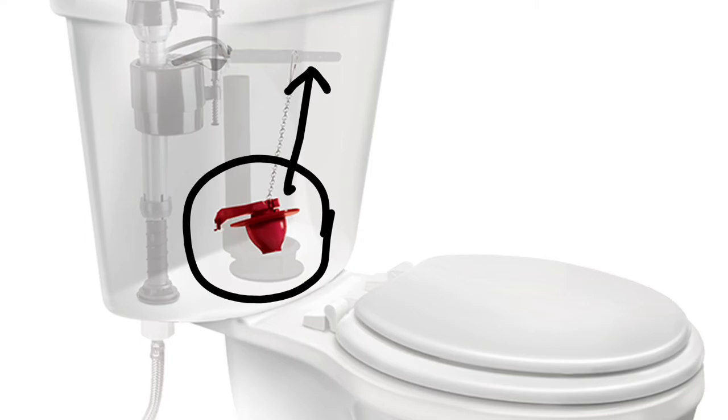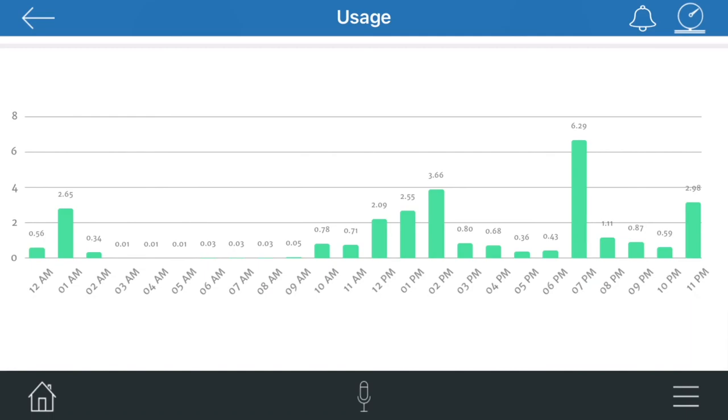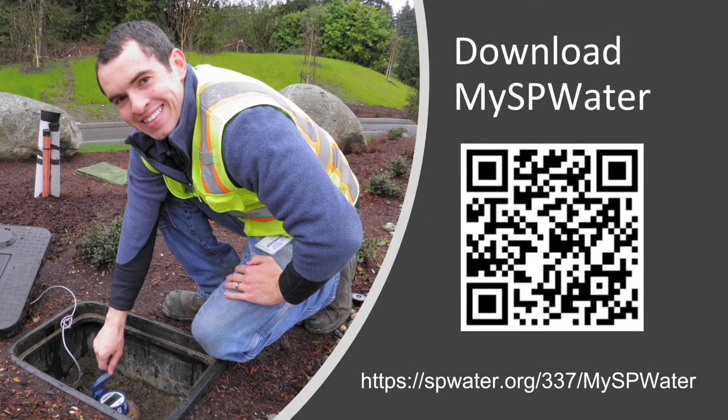But how do you know when to check for these leaks? That is where smart water meters come into play once again. Looking at this graph from my smart water meter, if you notice significant water usage overnight when no one in your household is awake or active, that's a strong sign that there's a leak somewhere and you should check your toilets right away. If you're wondering how to access these graphs for your own water meter, it's pretty simple. If you're served by the Sammamish Plateau Water, you probably already have a smart water meter — all that's left is to download the My SP Water app by scanning the QR code or visiting the URL on screen. If you aren't served by the Sammamish Plateau Water and your city hasn't followed the smart water meter movement, I encourage you to write a letter to your local government or water district urging them to rapidly advance towards a sustainable future by investing in smart water meter technology.